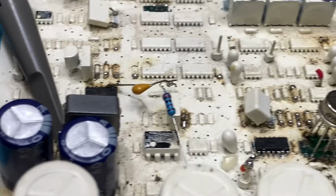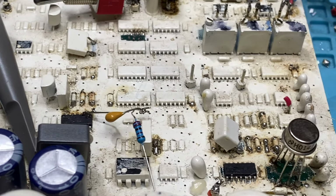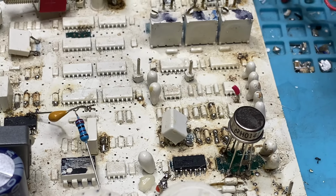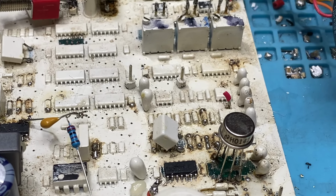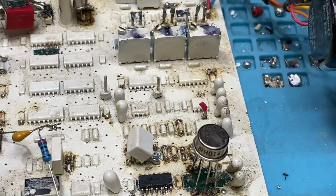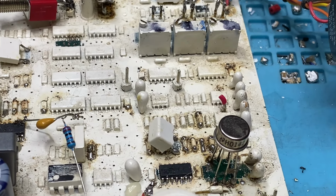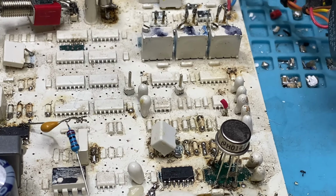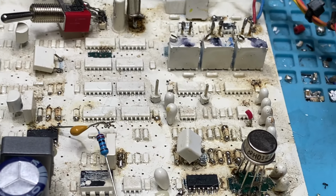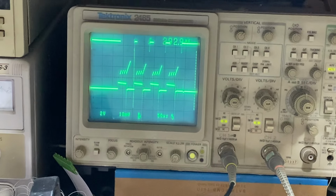It does. So you could put a scope probe on the collectors of these two transistors sitting here, and just put it on AC couple and go down and have a look in the millivolt range, and you will see power supply ripple all over them. So doing this, it gets rid of it in the receive window. So it's a bonus, guys. It is a bonus. There you go.